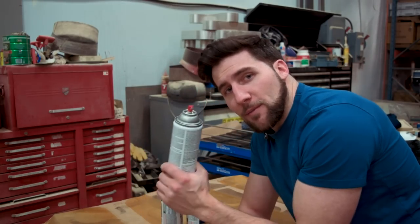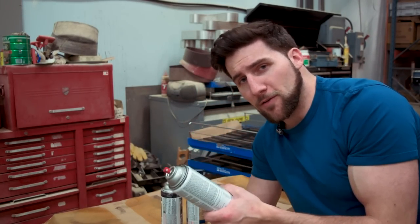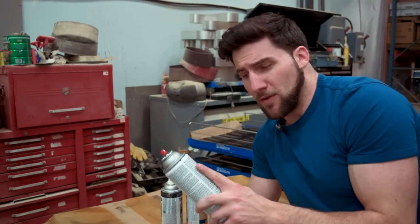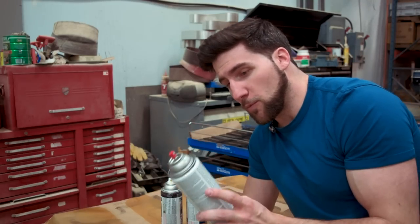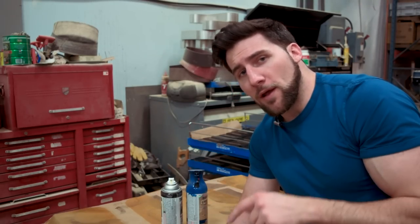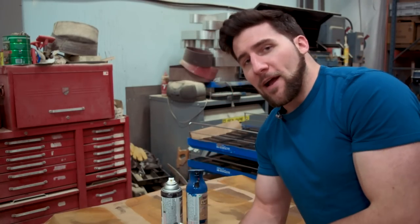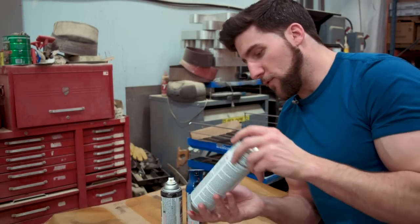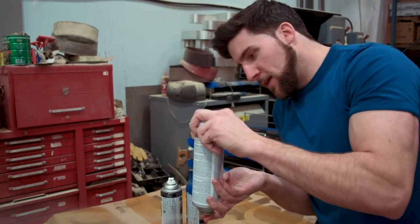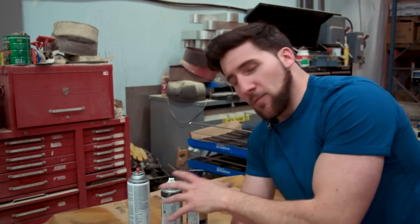For these guys, you can replace the tip as well or clean it, but you can also clear out the nozzle entirely from the bottom, because it's not a can that can spray upside down. So when you spray it upside down, you end up passing clear gas through there and that cleans it out. In fact, you're supposed to, when you're done using one of these, flip it upside down and spray it until clear gas comes out. So reason number two: something's clogged.